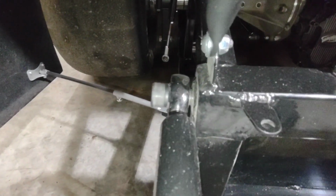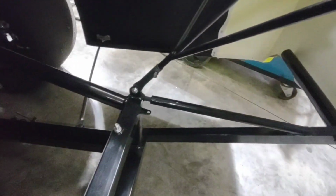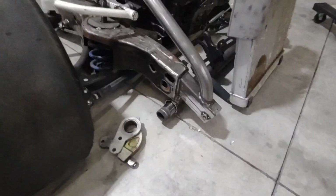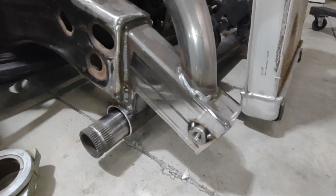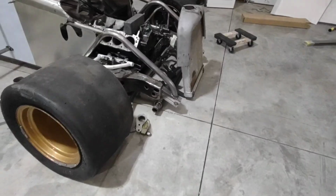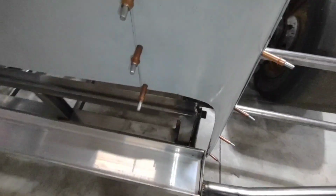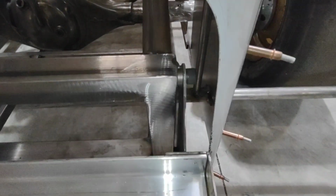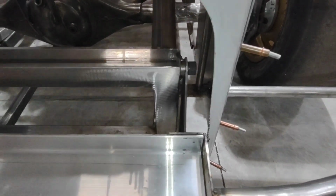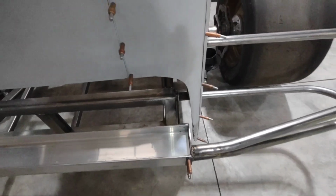Normally when I'm building a bumper for a car, I'll weld on these little weld bungs that go right into the end of the frame, but I always do the support rods. Another look at the weld bungs that I put in. This one isn't finished welded. This is on the front of my modified, but they're nice little threaded weld bungs. You can see again here in the back of my modified, the weld-in mount. It's just a really easy way. They're good, they're strong. If they get screwed up, just run a tap back through them.